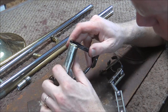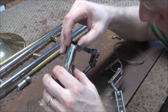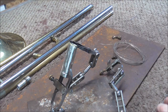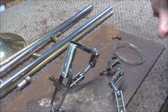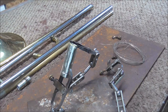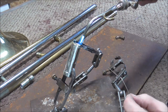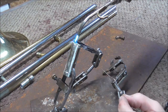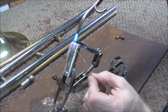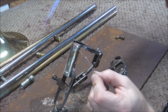If it's soft soldered together then it's a lot easier to unsolder it, clean up the solder and do it again — it still takes some work but it's a lot easier. When you're silver soldering it's a lot harder to do that. I'm just looking at it all the way around. Okay, it looks good so I'm ready to solder. I'm heating up the parts and what I'm going to do is tack solder this — where you just get part of it soldered and then finish it up. I'm just going to tack solder right over there.